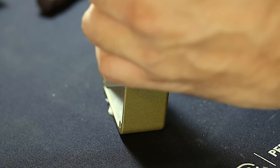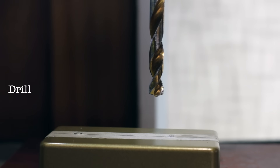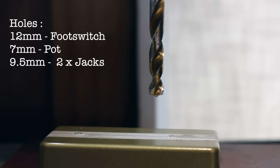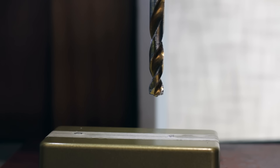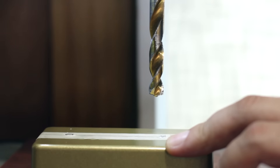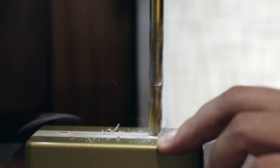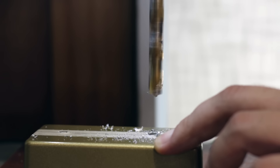We're going to measure 12 millimeters down - 10 mil in each side from those and then 12 mil up from the bottom - then dot punch those and drill them out. I've drilled all spots out to 3 millimeters as pilot holes for our main drills to follow. Then we've got a 12 millimeter hole for the switch, a 7 millimeter hole for the pot, and 9.5 millimeter holes for the jacks. Always start with your smallest hole, because if something goes wrong you can fix it - you can't make a bigger hole smaller. You can use a step bit but I find they can drift a little.